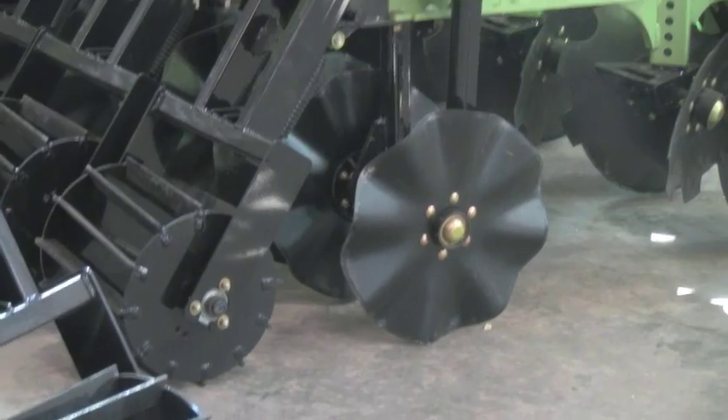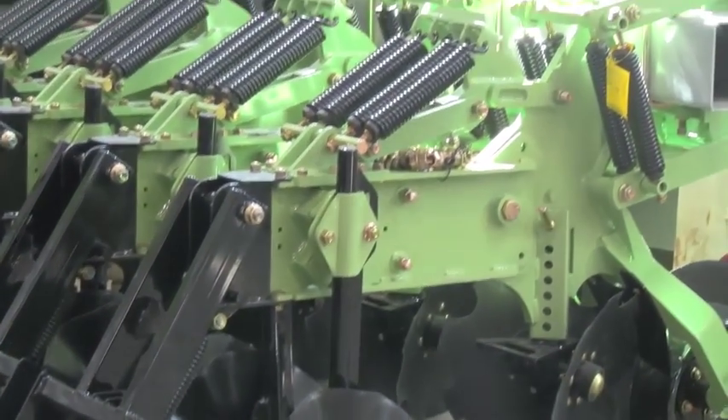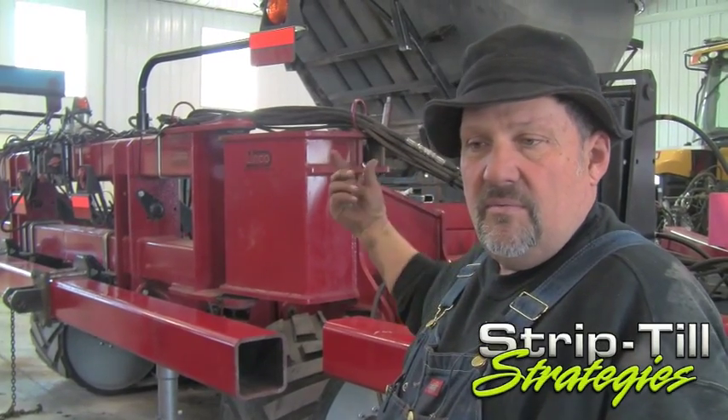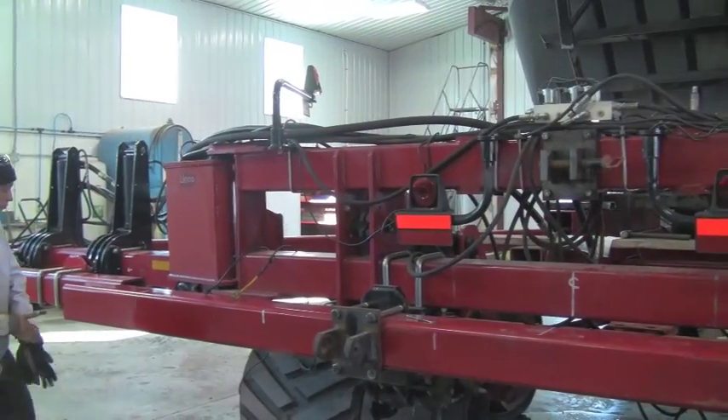With the unit we're putting Orthman strip-till units with the spring colter package on it — that's a double colter offset running about four inches apart. We'll be installing 2.5 inch dry fertilizer hoses to every row and running a diffuser, setting that up for spring application. This unit is going to serve a dual purpose: freshening up and aerating a strip for our crop while also running a fertility program at the same time. We ran a strip-till bar in fall, so we're basically freshening up that strip, hoping to generate more heat units than where the residue would be, to get our crop off to a better start.